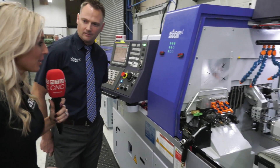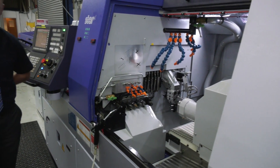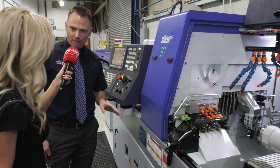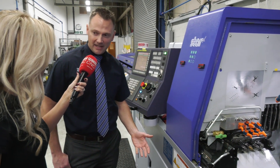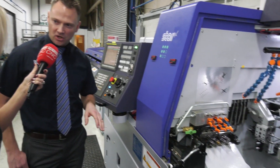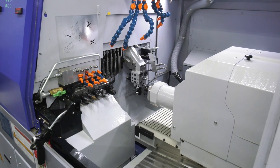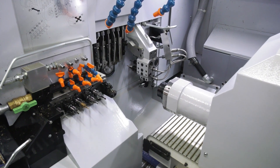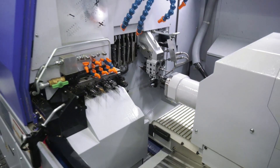Andrew was talking about quite exotic materials, so you're going to need a bit of power — and this machine is called a powerhouse. It's just over four tons, which is heavy for our type of machine. There's 11 kilowatts on the main spindle — the same power as our bigger 38mm machines — and up to three kilowatts on the live tools, so you can take a lot heavier cuts as well.